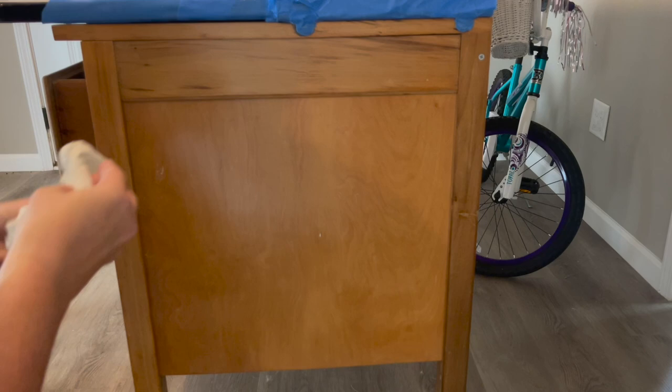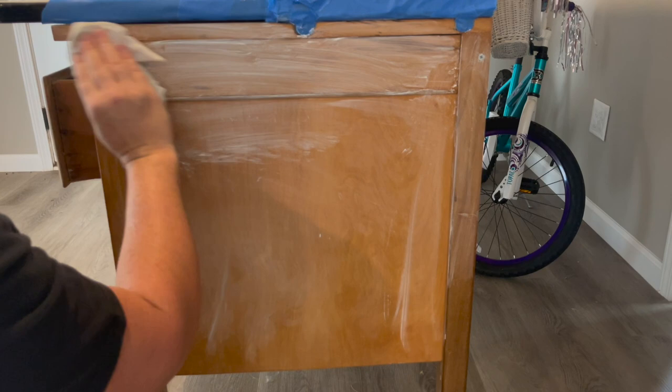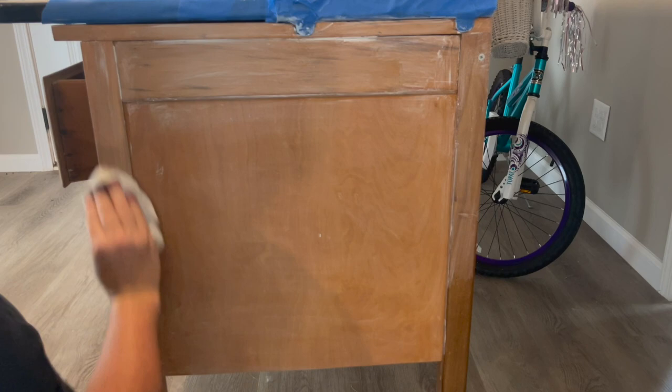So this added much more of a white color to this project. As you can see, it started in this very orange color family, and that is what my friend Farah was trying to get away from. So another thing with this really old piece of furniture is they use different pieces of wood, you know, like on the side and stuff. And right here, this big panel took the wax a little differently. So you kind of have to play around with it. You can see I'm just putting as much as I can on there and rubbing it in so that there's almost like a white sheen across it, and it really did take out the orange color, which was our whole point. And while preserving the work that her mom had already done to get this thing stripped.